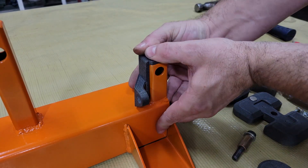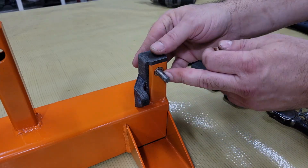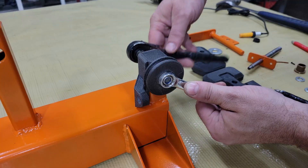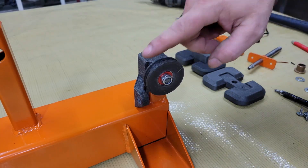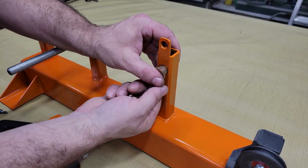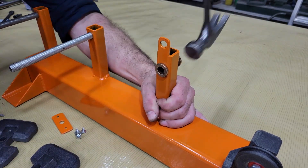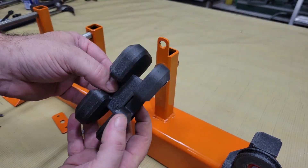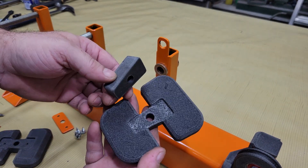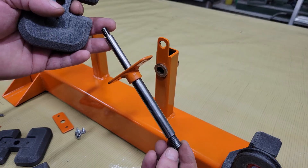The center of the mold is a small trapezoid with slightly tapered sides. The centerpiece is what the copper wire is wound around, and the tapers allow the finished coil to be demolded easier without coming apart. When it comes to making coils for air core stators, the size and shape of the centerpiece should match the size and shape of the magnets being used. If the center is smaller than the magnets, the coil windings inside the perimeter won't be energized and will be a waste of copper. If the center is larger, there's a waste of space resulting in lower power density.